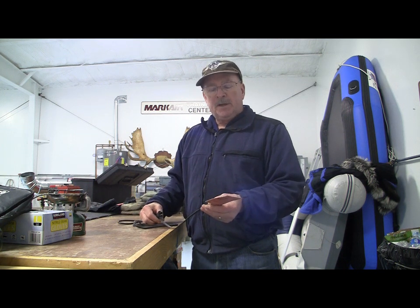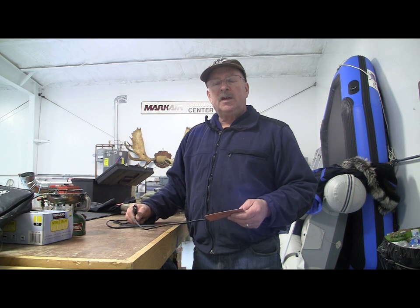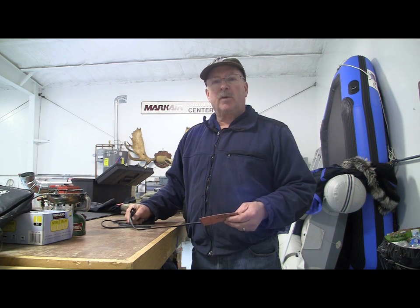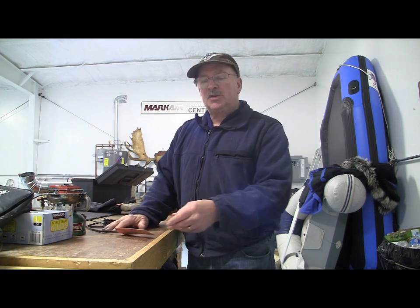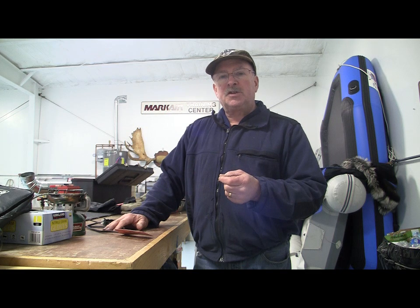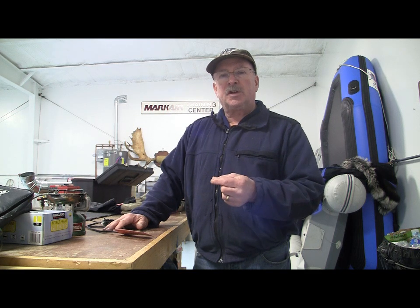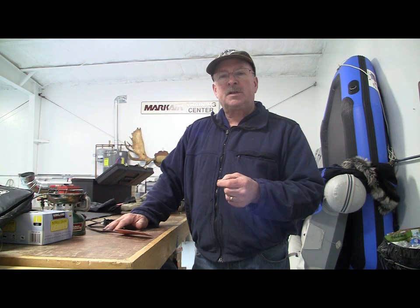The next step up is a designed preheat system for these aircraft engines. And there's pretty much two systems on the market right now. The TANIS is one system, and the TANIS uses a bayonet type heater probe that plugs into the cylinder head temp port on your cylinder. Well, like a lot of us, we have 6-point cylinder head temps, so we can't give up 6 ports.